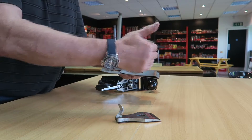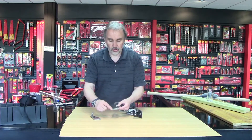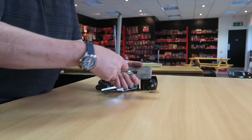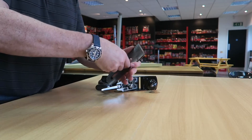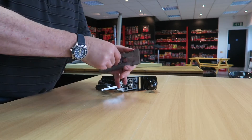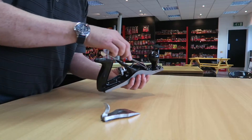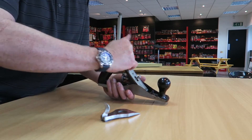If you need to adjust the cap iron, there is a blade here which should be about 1/16th of an inch, or 1.6 millimeters. The end of the cap iron is designed to go into the large screw. You undo it, adjust the cap iron, retighten using this as your screwdriver, then insert it back into the plane body making sure it's engaged in the slot.